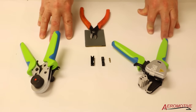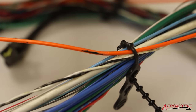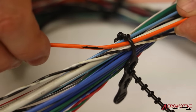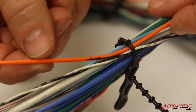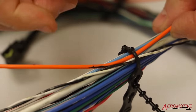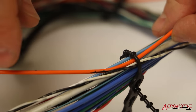So let's get started — I'll begin cutting, stripping, and crimping a fiber optic cable. We have an assembly here that has some fiber optic damage. The first question is how did we know this was fiber optic cable? Well, it's the color — this orange to mustard color is standardized. So whenever you see this in a harness assembly, you have to immediately start thinking this is a fiber optic cable.